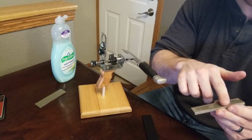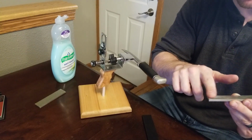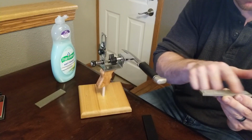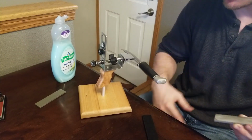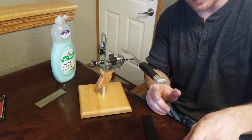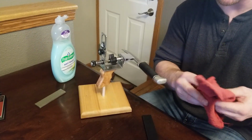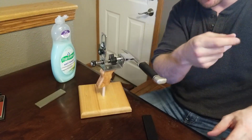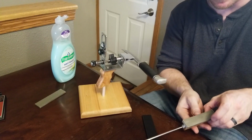On that side I did the downstroke thing and it didn't seem to work, so I was doing 20 up and down per side because it just seemed like I was making more progress without adding additional or unnecessary pressure. And then all of a sudden the burr started to form, so I just kept going and eventually got it the whole way. Sometimes it feels like the burr is more this way or this way and I have to tilt my fingernail to find it.